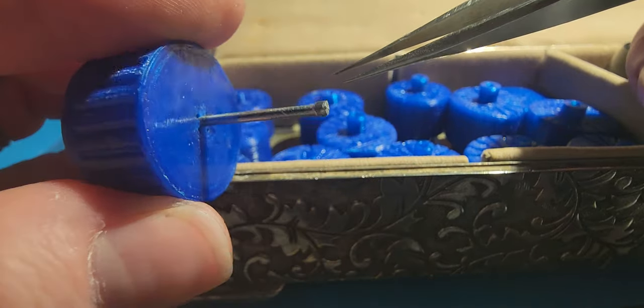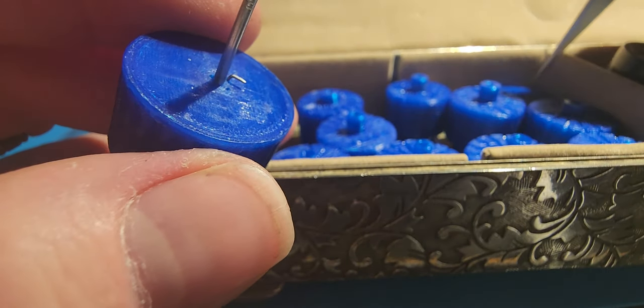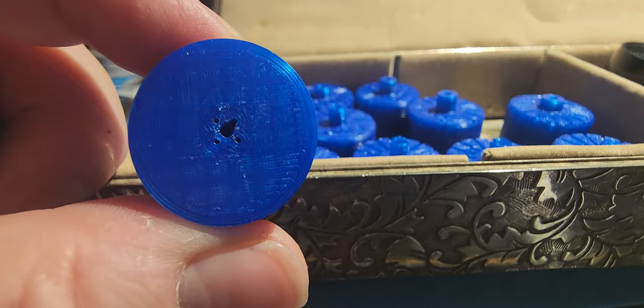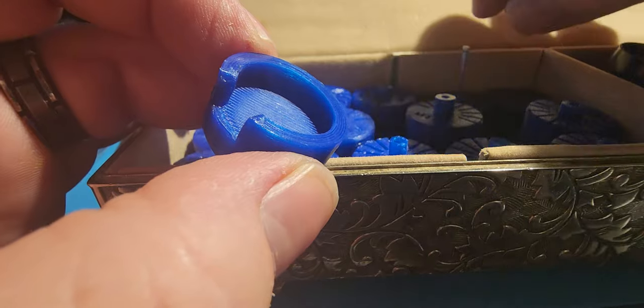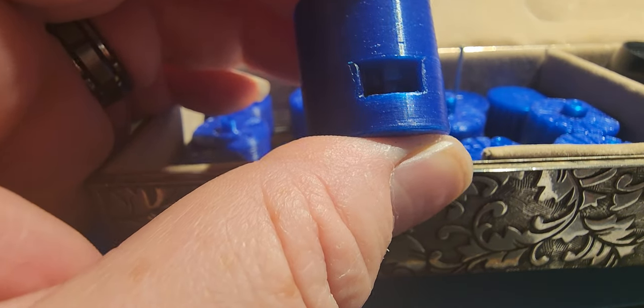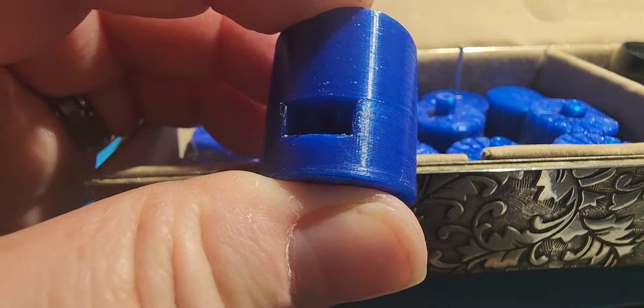This is just a nail I was able to push down into here — that's what they recommend, find some sort of one millimeter pin. This one actually might be for a two millimeter or one-and-a-half millimeter diameter. Then this is what you use after you've got the spring wound — you push this in here and then your plunger will push it in. I'll demonstrate all this at some point on an actual mainspring.